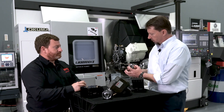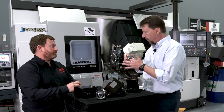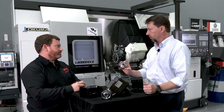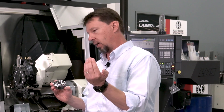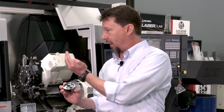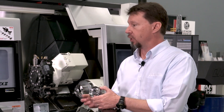Another unique feature on this part is the actual keyway slot itself. That's used a lot for timing and for holding pulleys. A lot of times we'll do keyway slots using a straight tool and programming basically a box shape with a turret. You guys offer a live tool that is actually a broaching unit itself.